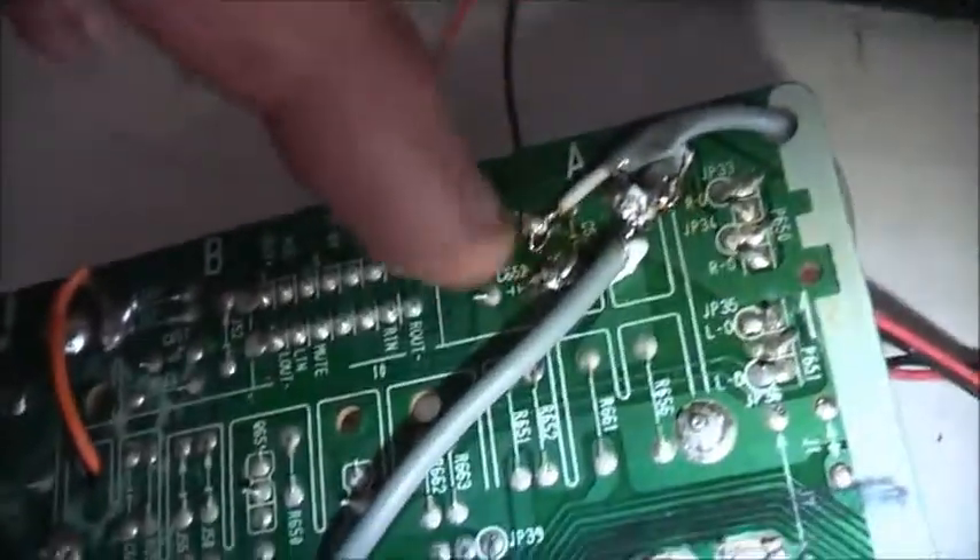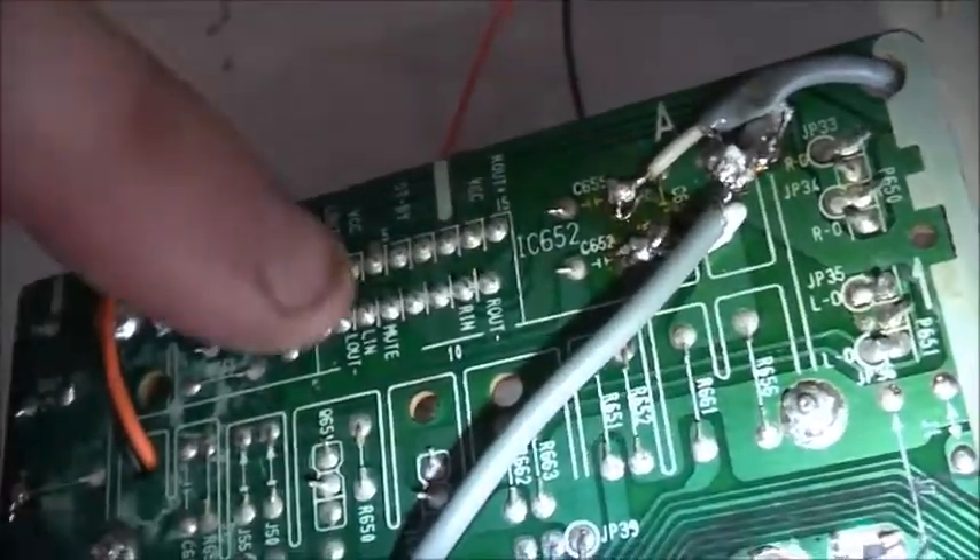That's a positive on the left and right inputs. Right in there. Right — left goes down. That goes in somewhere. Jump is here, goes here to this pin. Double check everything in here — that's connected the right way. I'll demonstrate it. I have to bridge these to positive so I've got two sets of inputs, because these are normally outputs.